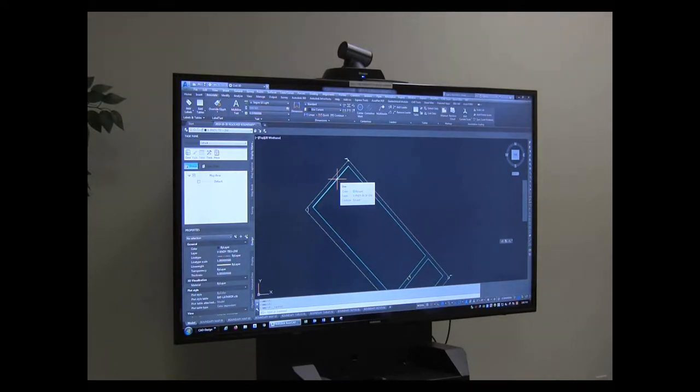This is San Francisco though. I could hold these monuments and throw the block out of record — but I have heartburn with that. If we tied these monuments with a gun and ran a traverse around this block, there's a very strong chance they would fit record. In fact, if I had to bet, I would bet they probably would. So now I'm in a situation where I'm going to do the exact opposite of what common law says I should do, because we didn't do a good job when we tied these four monuments out. Does everybody understand that? Why do we use GPS? Because we're lazy and it's quick.